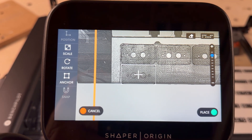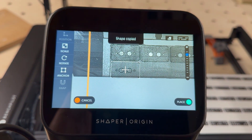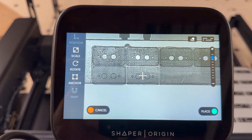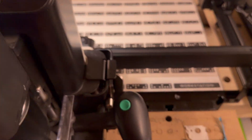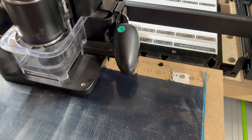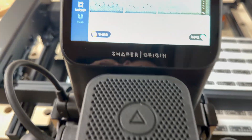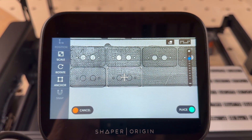It's quite difficult to do with one hand, but place it where you'd want it, then go to copy, move across and place it. Obviously in this I nested them as close as I dare, which worked out fine. I have actually already cut these parts. All I've done — 2mm or 1.5mm carbon fibre — I stuck it down on double-sided tape, carpet tape actually, because it's a lot cheaper than Shaper's version and it holds it in place just fine. Left a couple of mil gap for the 2mm cutter, or just over 2mm gap.